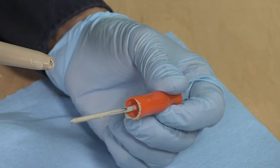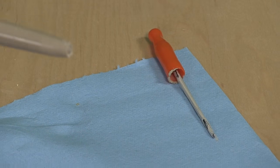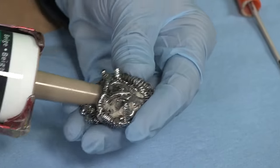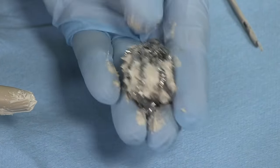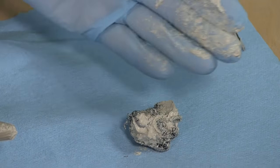All we need to do is make sure it's well covered and sticky. This is the best caulking closer I ever found — it's real soft rubber and has a spike, so it closes nicely and keeps the whole shaft open. We're just going to throw some caulking into the middle of the steel wool, not the outside — I want to go to the middle like we did with the foam. Depending on how big your hole is, you fill it up and the caulking comes through. There's no rodent on earth who's going to chew his way through that once it sets up. Jam it in, smooth it off, and you've got a permanent closure for those mice.